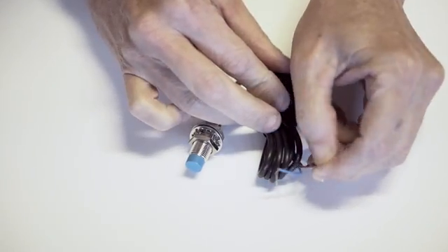Let's take a look at the voltages when the switch is engaged and not engaged. First, testing the voltages powering the proximity switch: the blue is the ground or V- and the brown is the V+, and we have exactly 24 volts powering the proximity switch. Now let's look at the output from the black wire. This is generally wired so that the switch connects to the controller via a common V-. When not engaged it should show 24 volts because it's a normally open switch. When we engage the switch and close the circuit, we should show 0 volts — it's showing 0.726, which is close enough.